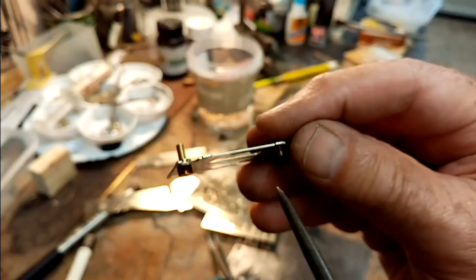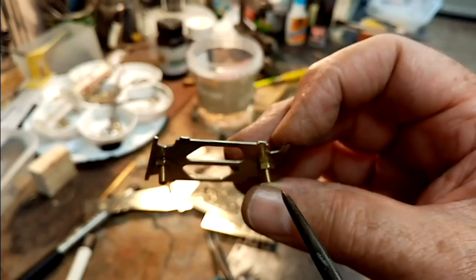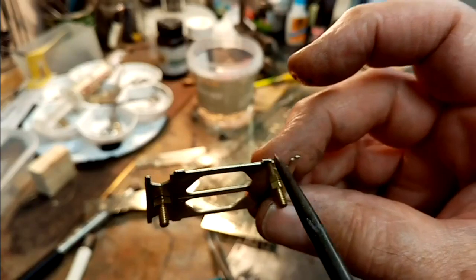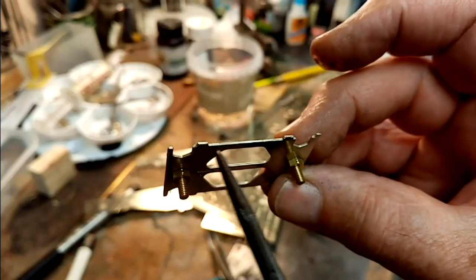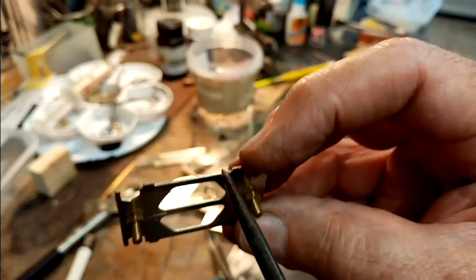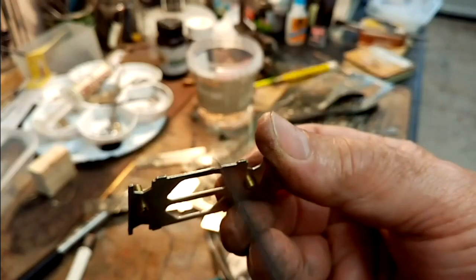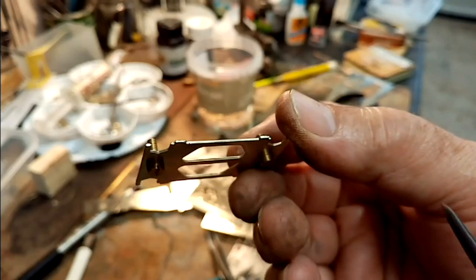What's more important at this stage, I mentioned earlier about trimming the etching cusps off, where it mates with the chassis mainframes, you must just dress it back to take the sharp cusp off, because otherwise you could end up with an oversized chassis, which might give you a lot of problems. So it only needs just a whisker taking off, just to make it a full surface, that's all.